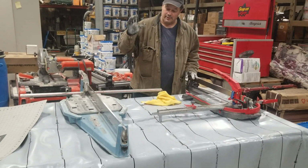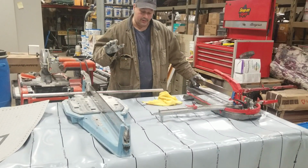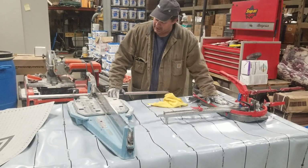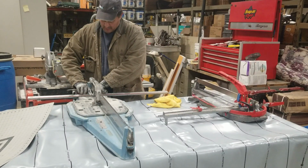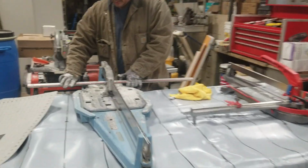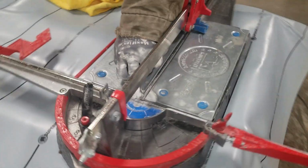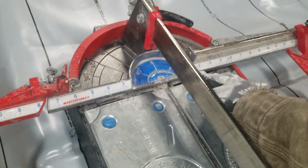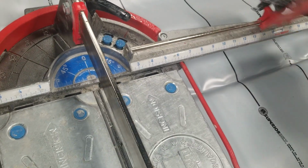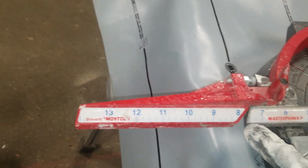One of the things that I'm going to say as a comparison with the bars. For the most part, on one-off cuts, the Sigma bar is much superior to the Monti bar. And the reason is, the Sigma bar starts at basically a 1/4 inch and goes all the way across with no breaks, and you can see exactly where your cuts are. Whereas the Monti bar also starts about a 1/4, maybe 3/8 in, breaks again here at about 1 inch, breaks again at this 2 to 3, then has a problem right here at the 16, and also breaks at the 7 to 8.